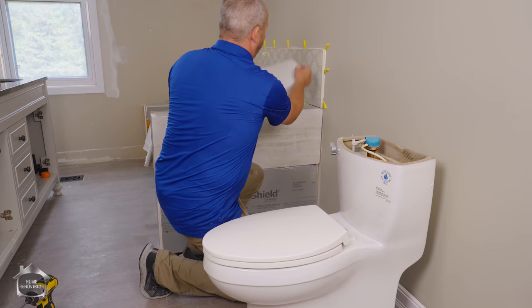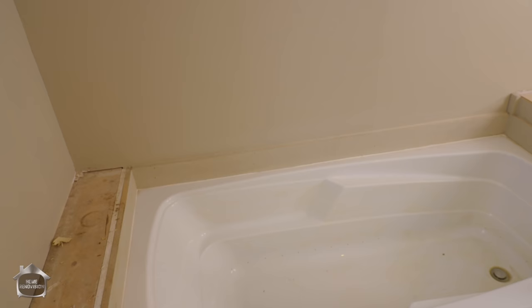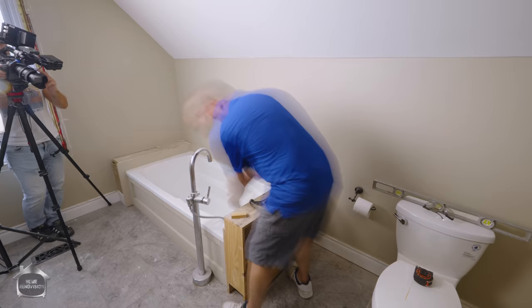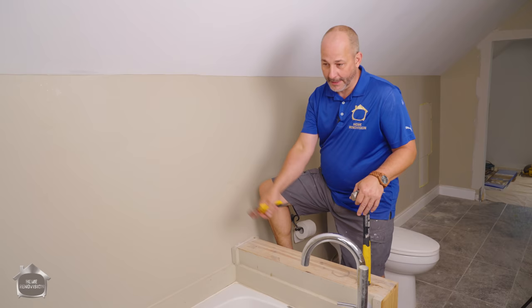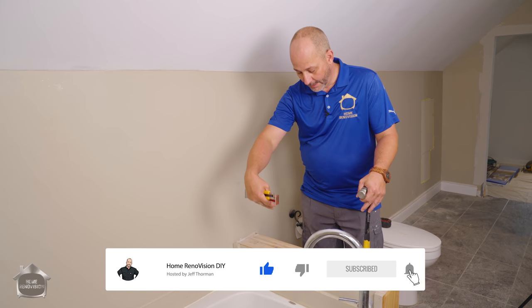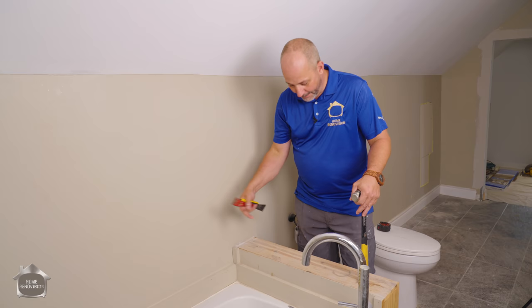Be very careful when you put the toilet on — you don't want to, at the last moment with a full tank of water, crack the tank. In this video we are going to renovate or remodel this tub area, taking it from this to this. The tub is actually a fantastic jetted tub — we're just going to peel off all the trims, get some proper substrate behind it, get some tile on the walls, and remove this here and build a new half wall. I'm going to have the tub faucet coming out of the wall — it's a beautiful new fixture. Right now I've got to peel this onion apart and find my way back to the original integrated tile flange of the tub so I can rebuild properly. The water is already off downstairs.